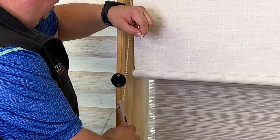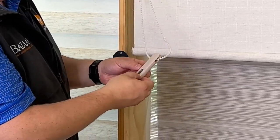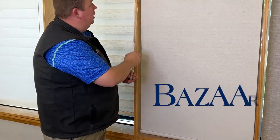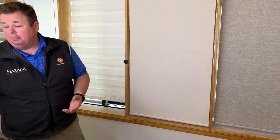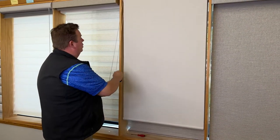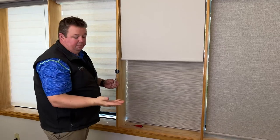I'm not sure if you heard that snap. We're looking for the other side to snap as well. Now I have my bead connected, and what I'm going to want to do is pull this down and just drop it to make sure it goes all the way to the bottom. If it doesn't, it could be because one of our bead stops is set in the wrong position. If when you're operating your shade you don't have a stop on the bottom, or as it comes up you don't have a stop on the top, that is because you don't have a bead stop set.